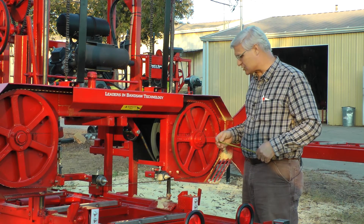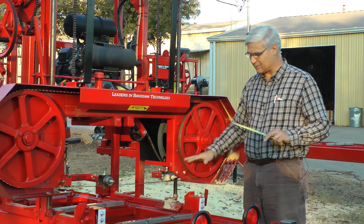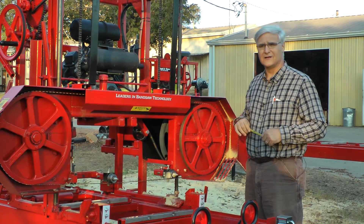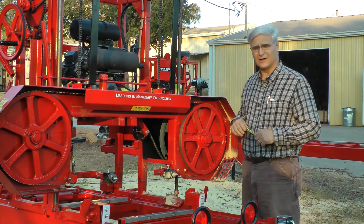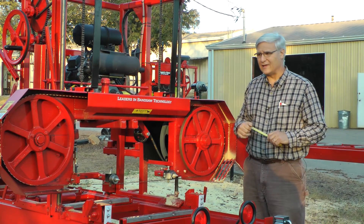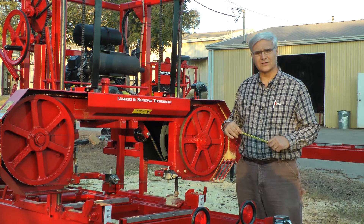That's what we consistently do. We've found that we can then control the blade with our roller guides and make it saw straight forward in the cut. It takes out some of that diving or dipping if you don't have it adjusted that way. So that's another tip from the five things we've talked about. Hope you're enjoying the videos and we're looking forward to bringing more to you.